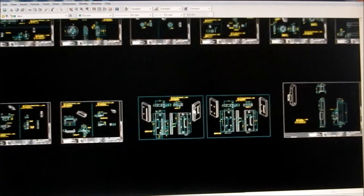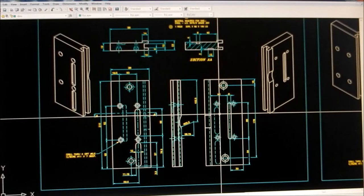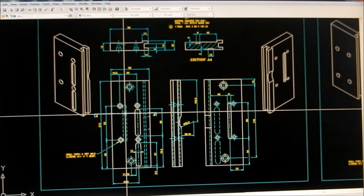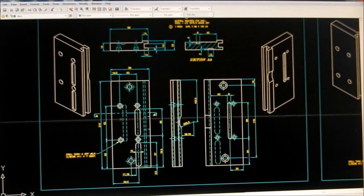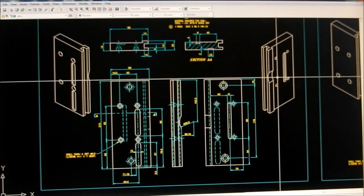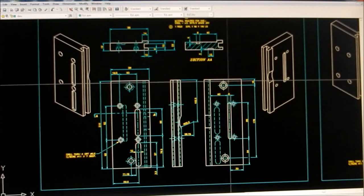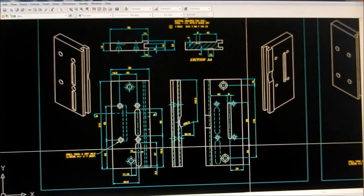Let's go up and have a look at the details. This is the one that's going to be mounted up hard against the side of the saddle — you can see that keyway cut in there to take that side load, and then the keyway that's going to be mating between this foot and the actual housing. The housing already has these pre-cut, and I've got a small scallop just to clear the end caps and bearing caps on the housing. I've put in where the mounting holes are going to be — two holes I can already pick up on the saddle itself.